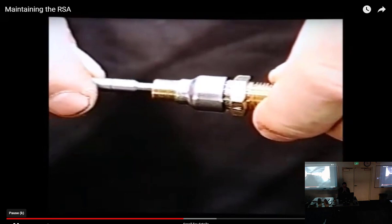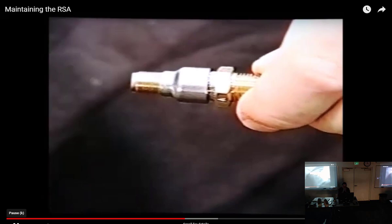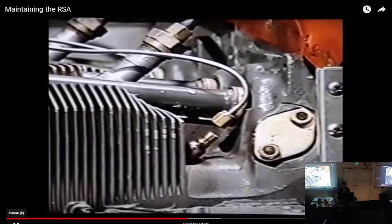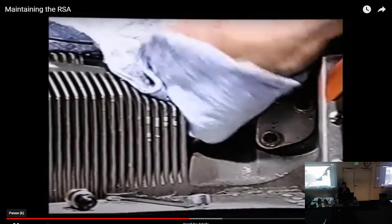On engines that have nozzles installed horizontally, leave the shipping cap installed until you connect the fuel line. Improper line connection is a common source of damage. Again, with the two-piece nozzles, failing to follow procedures usually means a new set of nozzles. When installing nozzle fuel lines, make certain all threads are clean. It's first necessary to install the nut finger tight.